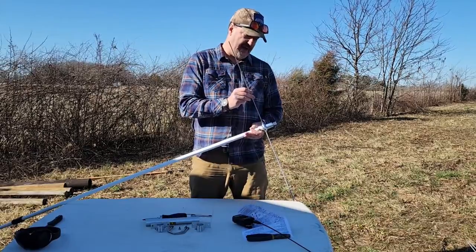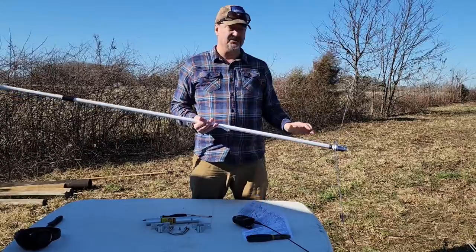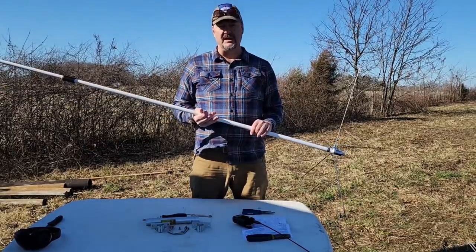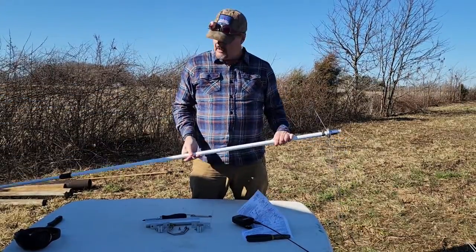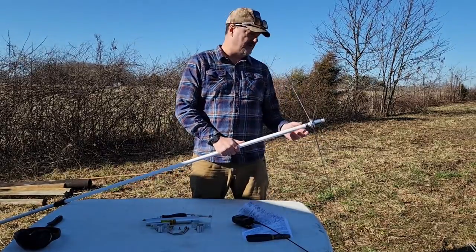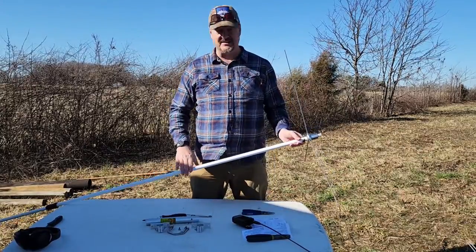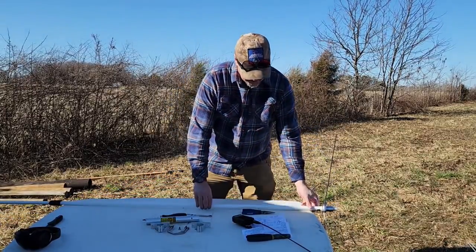And for those of you that haven't maybe played with antennas like this, these radials are used as a way to project your energy. So these are pretty much a flat plane. You sometimes see radials pointing downwards a little bit on other antennas, but these are pretty much 90 degrees with the actual antenna element. So the radials are now on there.